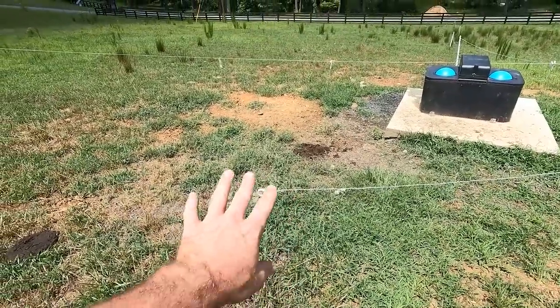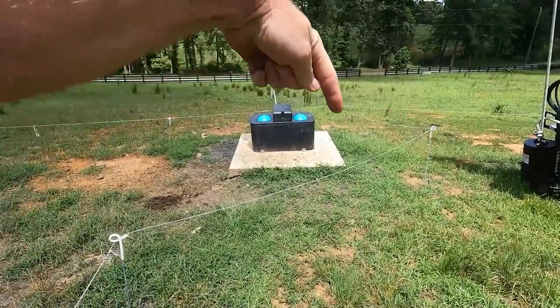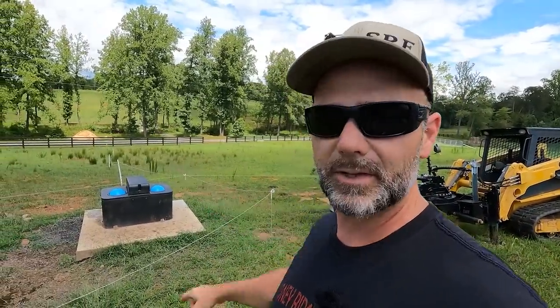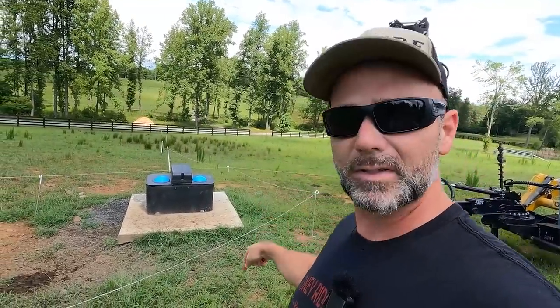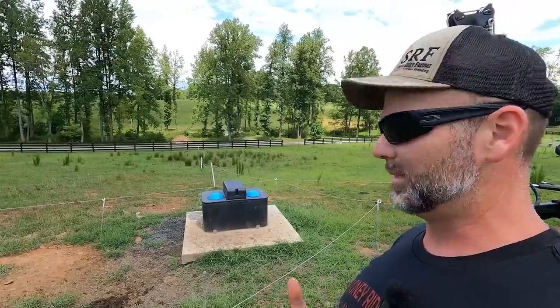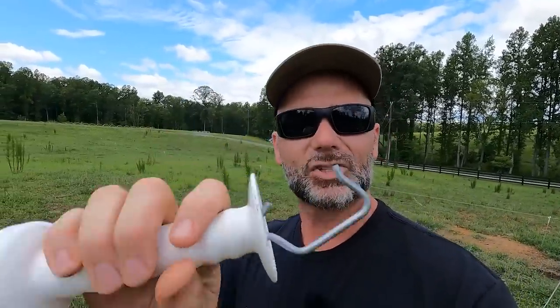I'm going to put in these steel posts — two-inch SS40 from Farm Fence Solutions, I believe eight feet tall — and knock them into the ground pretty far. They only have to be the height of this step-in post to support what we're going to do. We want them fairly low but not so low that the cows get injured. We're going to put one post here, one there, one there, and one over there. The math I came up with is 15 feet out from the center of the waterer — this is a Mirafount 3390 — and I'll show you how that works.